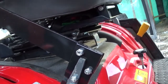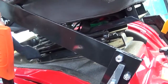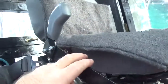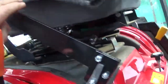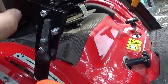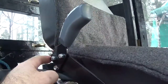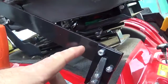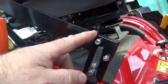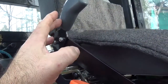What I used is this piece of flat metal bar here — it's 3/16 of an inch thick and one and a half inches wide. I could have gone a little smaller; it might be a little heavy because if you lower it, it will stay down, so I might put a small counterweight to help it come back up. This piece is four inches long, the long one is 14 inches, and this piece here is three and a half inches.